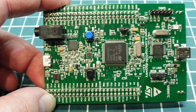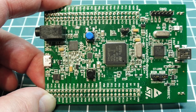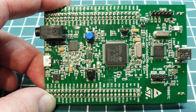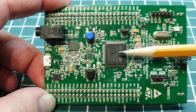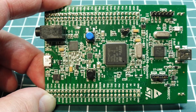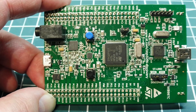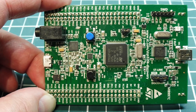The next board is made by STMicroelectronics — this is their Discovery board which contains a Cortex M4 ARM microcontroller, the STM32F407. This microcontroller can run at 168 MHz and has one megabyte of flash on board, so you can write very large applications. Part of the board is a hardware programmer for the chip, and you need STLink software, available free from their website, to upload your program through the USB port. I run Forth on this microcontroller and interact through the serial port using TerraTerm. If your project needs a very powerful, fast microcontroller with a lot of memory and peripherals, this might be an option for you.